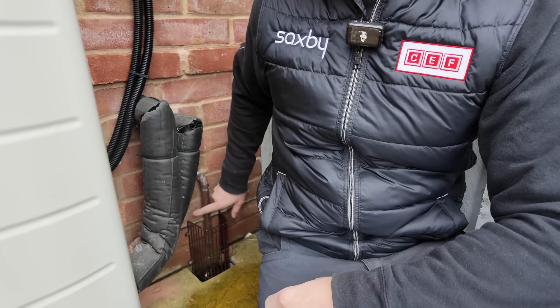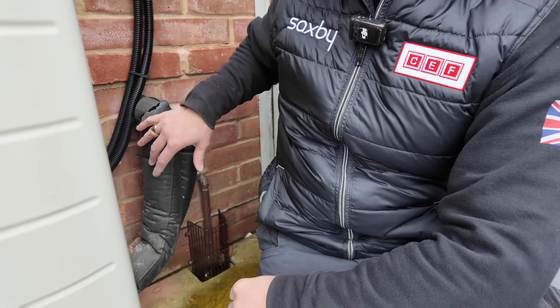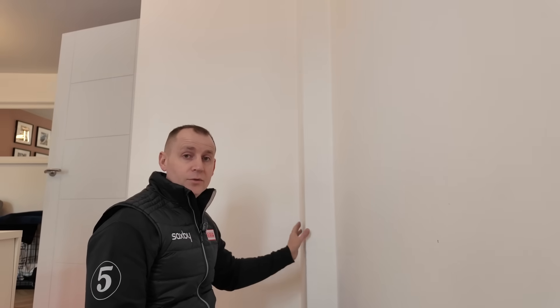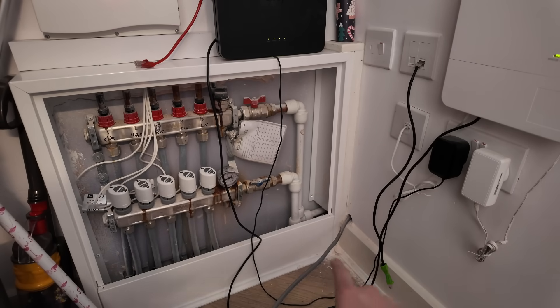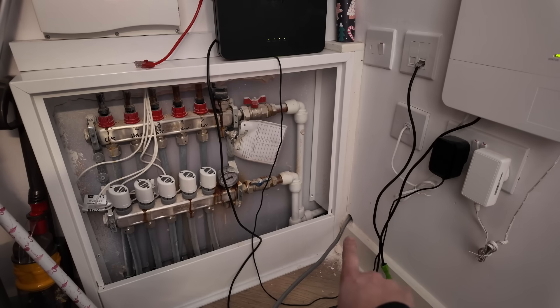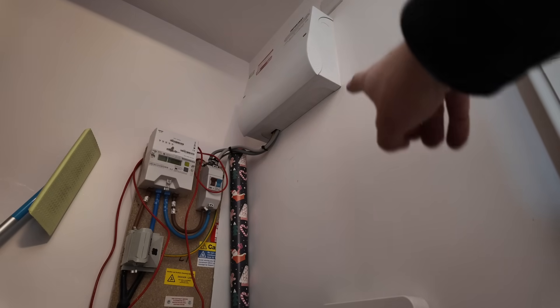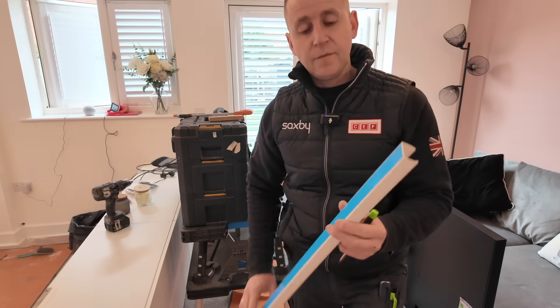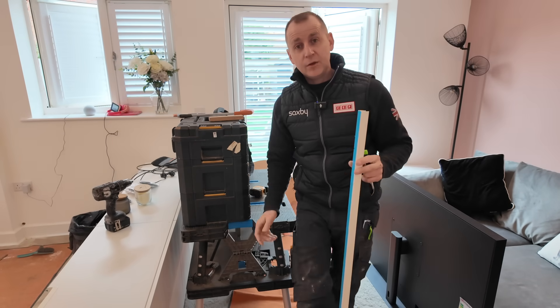Down in this little gap we've got a pipe here going into that service panel ducting area and some more pipes. I've managed to drill a hole through there where I'm going to stick my junction box, but it's too risky coming all the way through — I don't want to hit any of these pipes. On the other side I have another service panel and inside here is all of this, so I couldn't go through the boxing. I've had to bring it along with my twin and earth coming out there, running trunking along here and up to the consumer unit. The trunking I'm using today is 25 by 40, which is the same depth as the skirting, so hopefully it'll blend in okay.